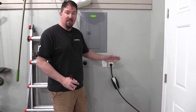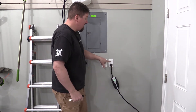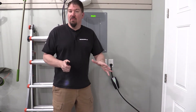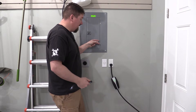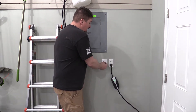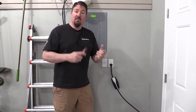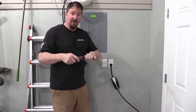If you're in your garage and you have a single outlet that's a 20-amp 110, there are three wires: your hot, a common, and a ground. Get an electrician to look at this before you do anything. If you wanted to change your breakers, you could change that plug to a 20-amp 220, which gives you hot, hot, and a ground — that will give you 16 amps of charging at Level 2.